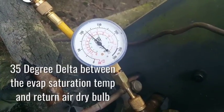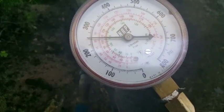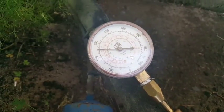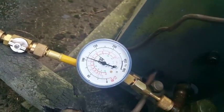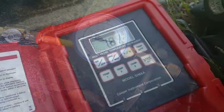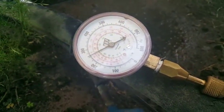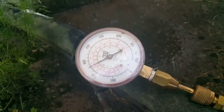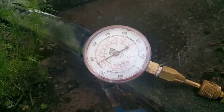That's going to be pretty close, actually, so we'll have to check airflow first and see what our temperature split is as well. We have 250 pounds on the high side, putting us at about 85 degrees there, and we're about 10 to 15 degrees cooler than that ambient — so that might be a little bit low of a split for the outdoor delta. I need to get some airflow measurements to confirm and check these run capacitors again. We have 78.9, around 79 degrees, which gives us right around six or seven degrees of subcooling based on a saturation of around 85. So we do have subcooling, just not a whole lot — but definitely not an excessive amount you'd see during an overcharge.